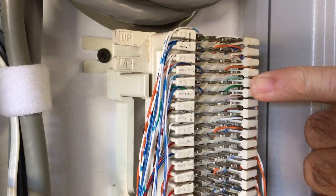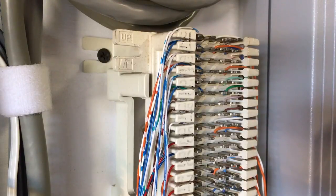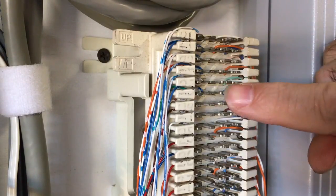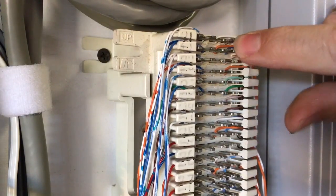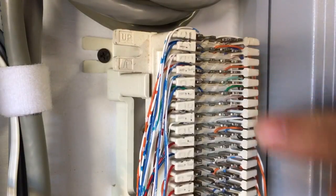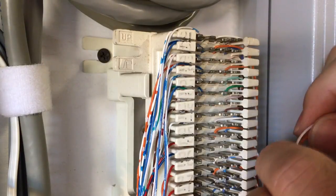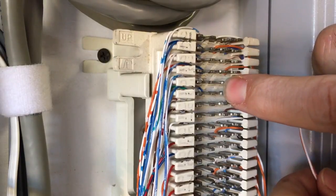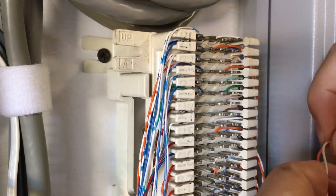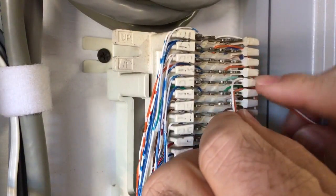So let's get in close and I'll show you what that looks like using the pliers, the screwdriver, and the hammer. Let's say that right here where this green pair is terminated on the outside pins, we need to cross-connect this pair of jumper wire onto the next set of pins. On a 66 block, every set of pins is paired — these two are paired to each other, these two are paired — and down the middle is like an invisible split, so the pins on one side are not connected to the pins on the other side.